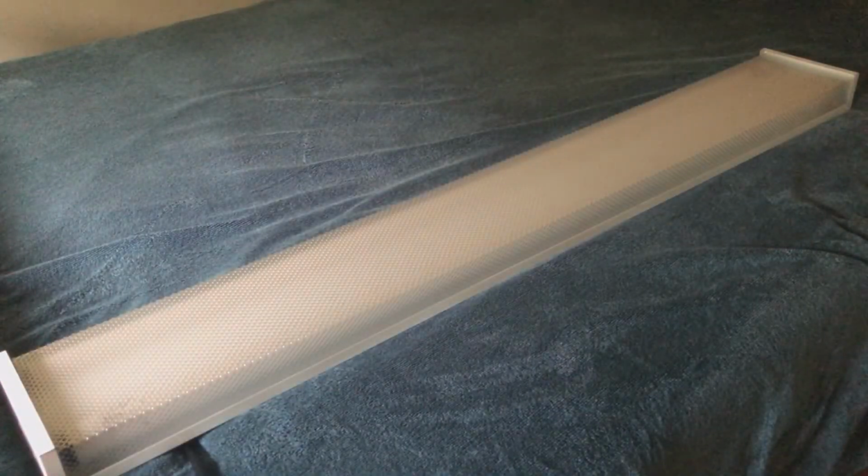I'd say this ballast is pretty bright for a residential grade ballast. Because of course this is, quote, normal power factor, which is just a low power factor ballast, but it powers the lamps brighter. So that's all that is. There's no difference in the power factor. It's literally just powering the lamps a little bit harder. So at least it's normal brightness. At least I think it is. Looks like it. But it's still not that great power factor. And the ballast is also pretty cheap as well still. Maybe not the best quality.